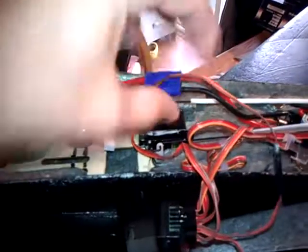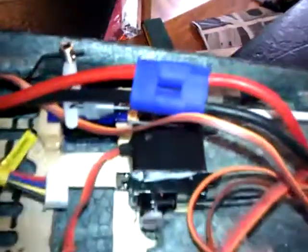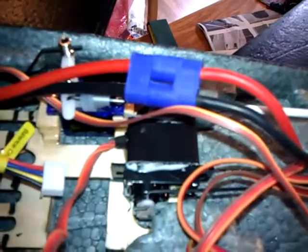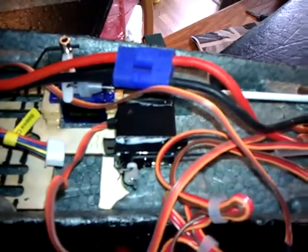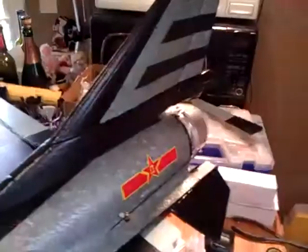That's where I'm at. I just need to go in here, get all this out of the way, clean up all this junk and all my wires, mount everything up nice, and make sure my antennas are clear from all my wires. That is where I ended up mounting servo 4 — that is the up and down on the thrust vector. I just did the good old trick of using duct tape, wrapping about 4 wraps around the servo and then epoxying the servo to the plywood board. That is Gorilla duct tape — they make a very strong duct tape. At any time I want to take that servo out, it itself is not epoxied to the board; I just have to cut the tape and I can pull it out. But it makes a very solid mount for the thrust vector.